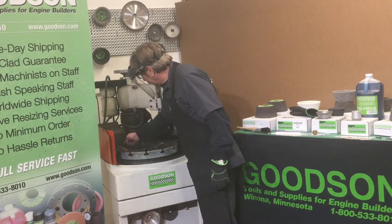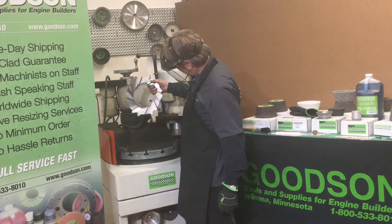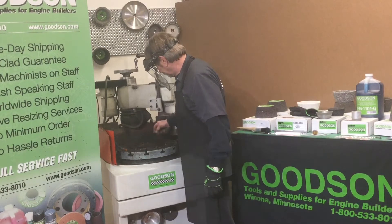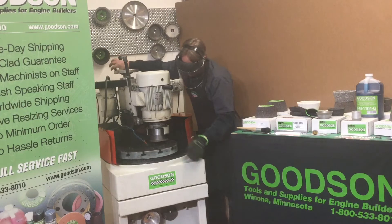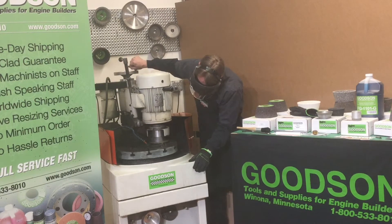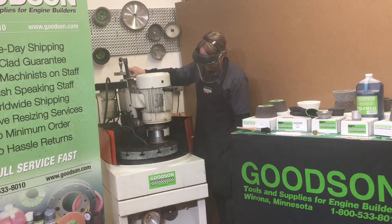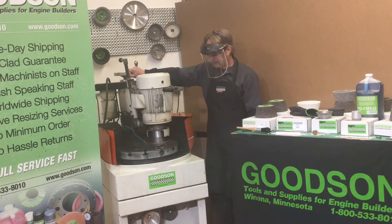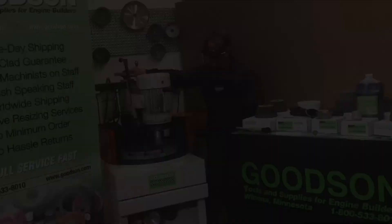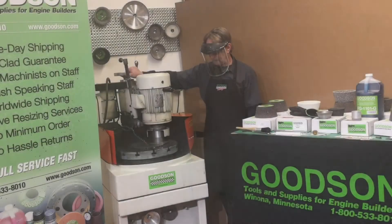That cam action puts the side pressure needed to hold this floater in place. I've got it cleaned up all the way around, so now I'm going to slowly grind this other side. Machine on, get that grinding wheel fed down on there, and we'll just start to break that water before we start feeding again. Now we want to grind all the way through on this side — make sure it's cleaned up completely. Going flat on this side will help me maintain that parallelism, which is very important on these floaters. Just about got it cleaned up now.